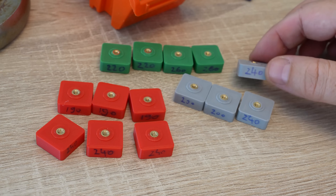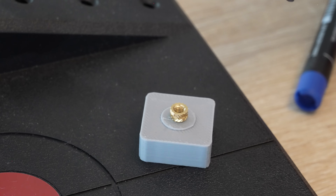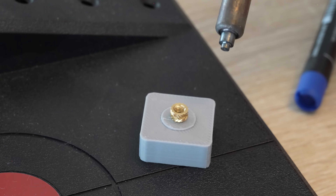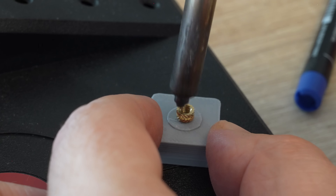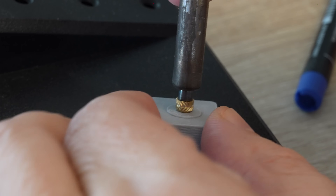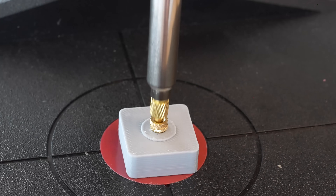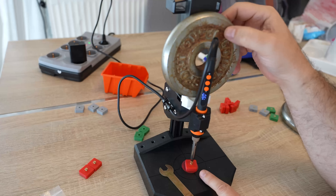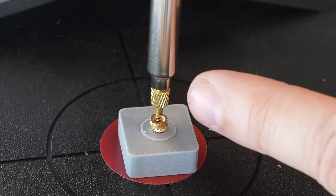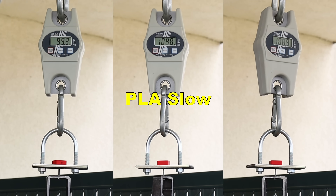First I want to show you something that was new to me. This is my old soldering iron tip made from steel — not the best material for this, but I could clearly see where the insert ends and where the soldering iron starts, so it's easy to stop on time and press it flat. With the tool made from brass it's hard to see where the insert ends, so I have to be more careful to stop on time. Maybe a copper tip would be better, or maybe color the surface somehow.